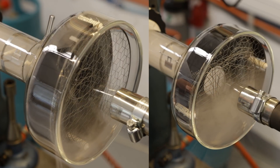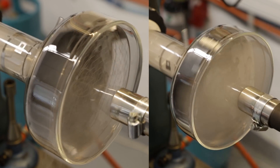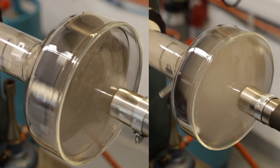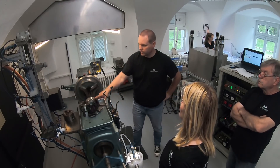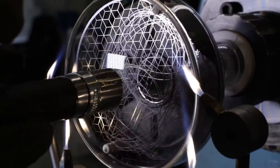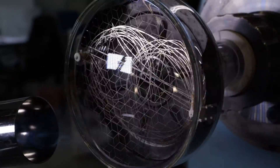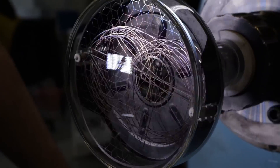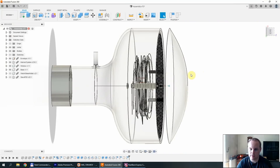The density of the fog in the area of the digits was way better than in the previous attempt, so we thought we had a solution. If the smoke can fill the tube, then the purging gas can probably fill the tube too and protect the digits from oxidation. So we decided to take that tube with the hole in the anode cup and seal it. I sealed the tube the usual way: first five minutes of purging, then sealing the window, closing the purging valve, and annealing the tube. After this, the digits were again oxidized — a little bit less in the area around the hole. That was not very encouraging after all this work.